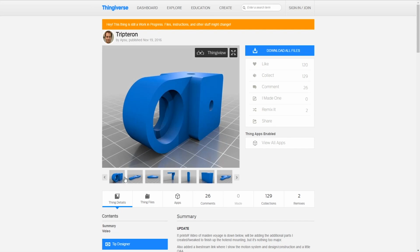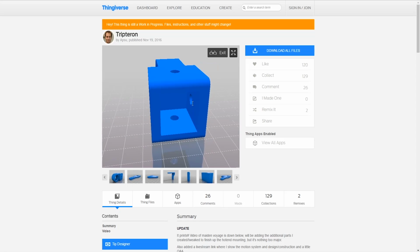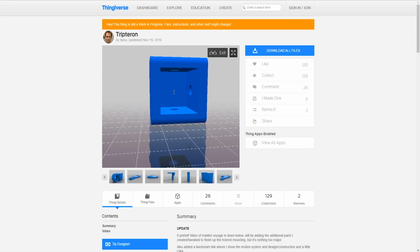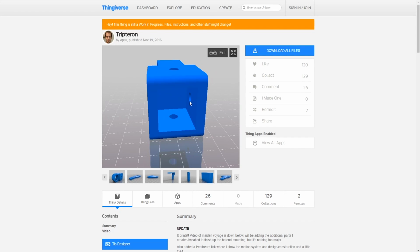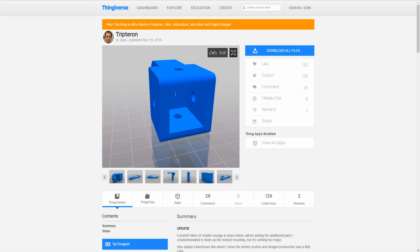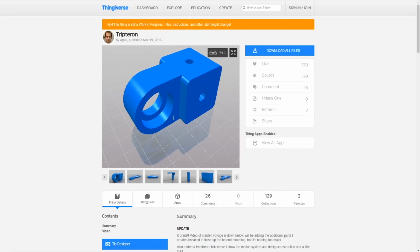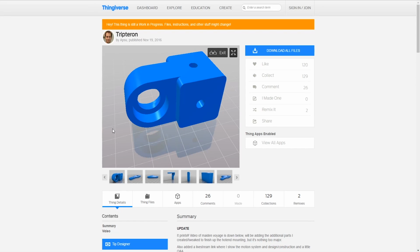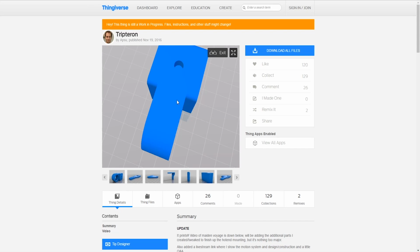Where's the tongue? This is the tongue. This one has a hole in the top here. So you can't print it with this orientation because this is floating. You can't print it with any orientation that rotates without this being floating or this being floating. And then you can't print this flat on the plate because now this top piece is floating, so you can't put your 2020 in there. So how I printed it is I printed it with this flat. Now with this flat, you have this overhang. This is overhanging. This should have been a 45 that way, or a 60 that way.